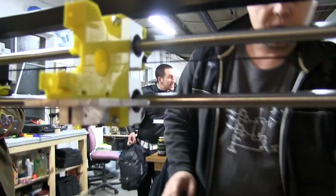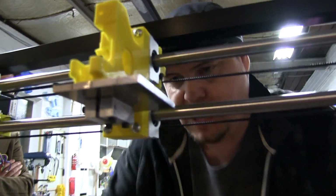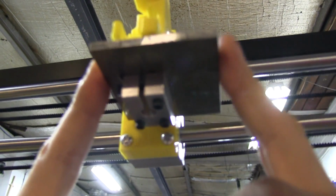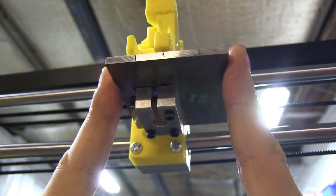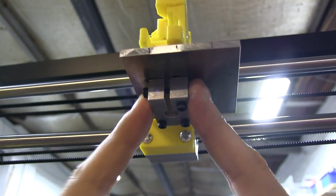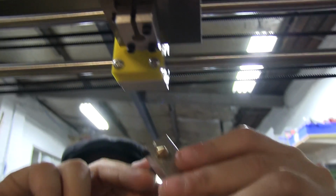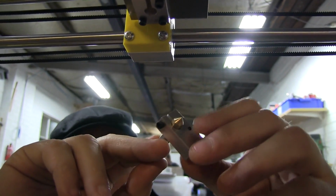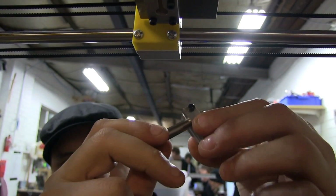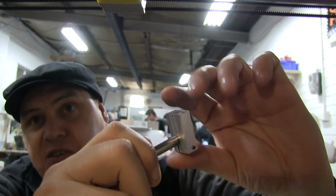You're using an extruder designed here, is it? Yeah, well, this is our own design. Basically, this is just an aluminium plate, because it works as a heat sink. We've seen someone create an idea with this, where I think Joseph Prusa created an idea where the actual heat block clamps on, and then we now use heated cartridges rather than resistors like they're using now.